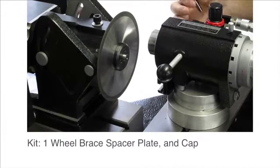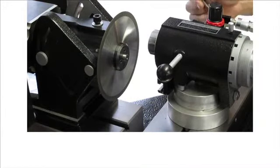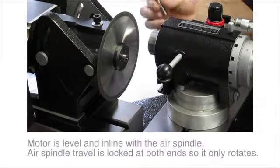It'll fit on any Cuttermaster type machine. In the case of the Journeyman with the DC motor, we're going to run at about 2,000 RPM. You've got to have some speed because the tool is pretty fine. This has been formulated for dry grinding. We're going to cut off this Destiny Raptor here that's been beat up on the end.